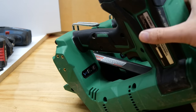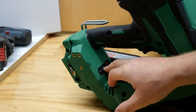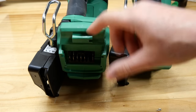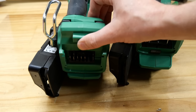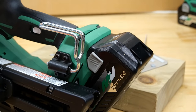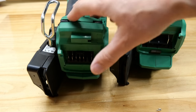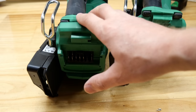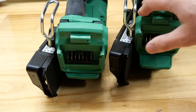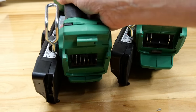The power button is unfortunately, just like the framing nailer, in an annoying place and hard to tell whether it's turned on because the lights are hard to see in sunlight. They've made a modification where the battery goes on — there's a bit of suspension now on the new one so the battery isn't getting blasted by all the impacts, because you're nailing onto metal. It seems like it has more recoil than the standard framing nailer, because you're going metal on metal — it's a solid stop every time, whereas with timber it naturally goes as deep as it wants.